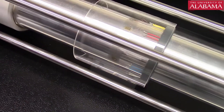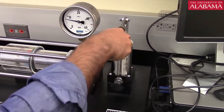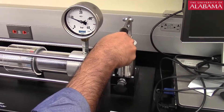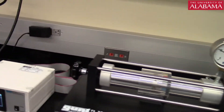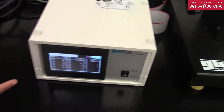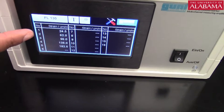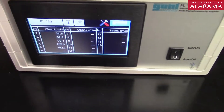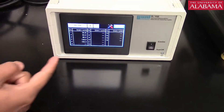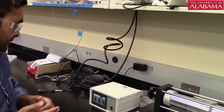Let me show you one pressure data point. I will pump it up to 10 bar. At 10 bar, let's come to the strain indicator. Give some time for readings to stabilize before recording data. The first channel — the zero degree gauge — is showing 24.8 micro-strain. The 45 degree gauge is showing 96, and channel five, which is 90 degrees, is showing the maximum at 182.5. So the strain varies with gauge location.